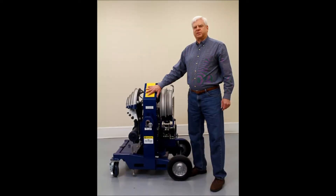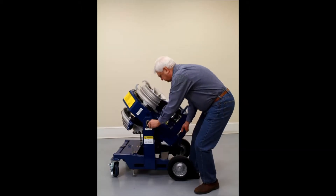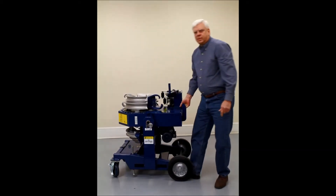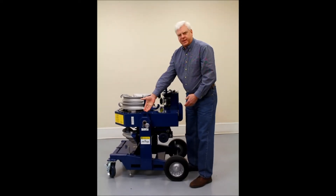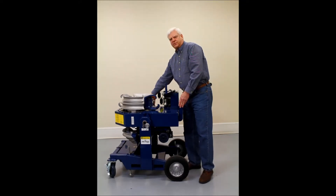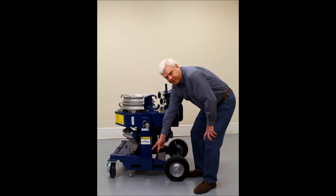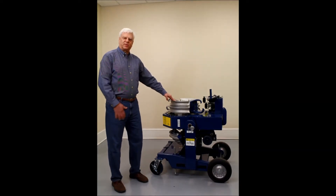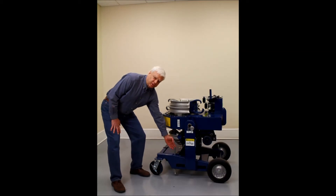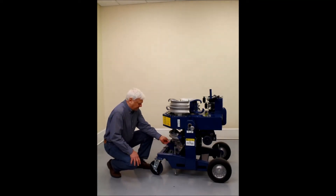The 747 also tilts for horizontal bending and transporting. It has a position locking screw to remove excess play. It also has two lifting eyes — one on each side for hoisting — and fork pockets below for lifting with a forklift. The unit has large wheels and lockable swivel casters for easy mobility, four leveling screws for leveling the bender before bending, and a lockable storage box in the back for your accessories and roller supports.